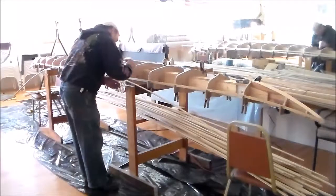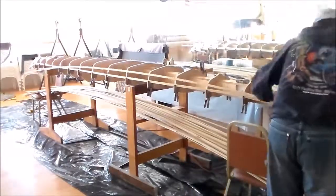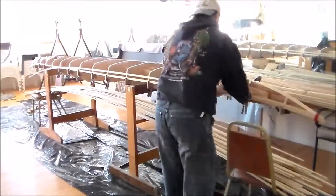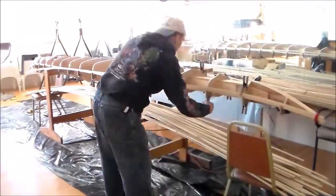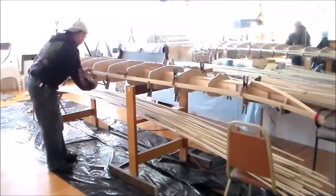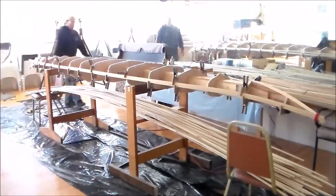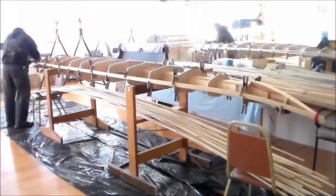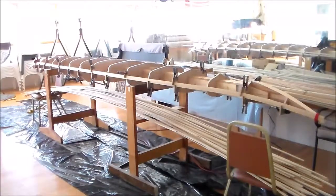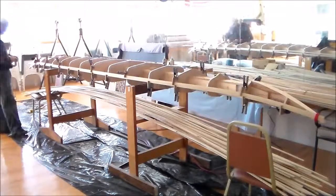Here I'm applying the glue to the cove and putting glue on the internal stem. You can see here on the nose of the kayak a red bungee — that's a tarp bungee. It makes excellent glue clamping for these strips. After each strip is glued and clamped, you have to wait until the glue dries before you can move on to the next strip.